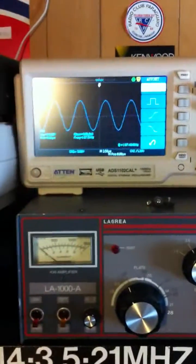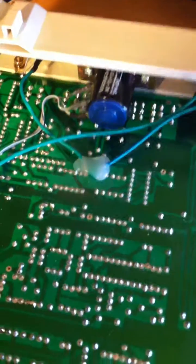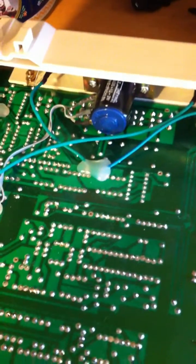But now it works. I had to dismantle, take off the covers and everything, and take a look inside this unit. And it showed — it turned out to be about 20–25 soldering points that were not soldered from the factory. I thought it can't do anything wrong if I resolder those places. And now it works without any problems.